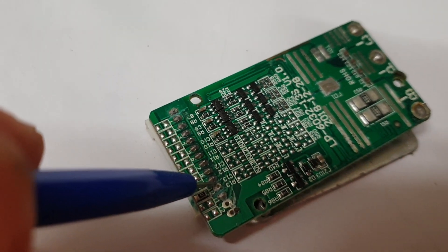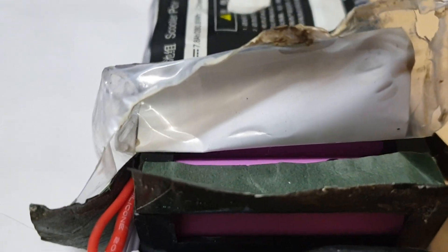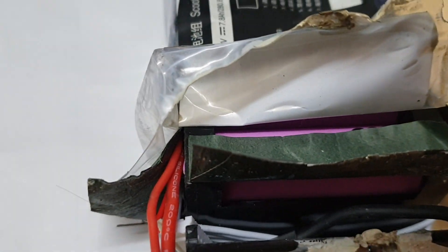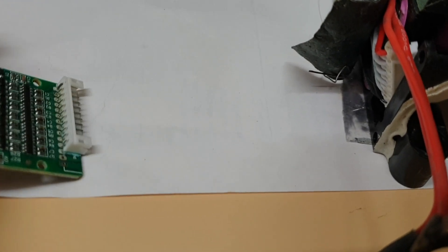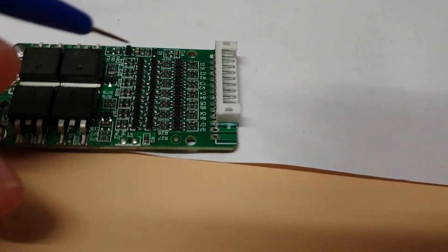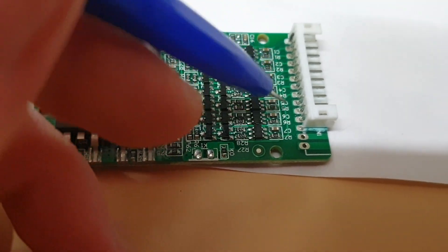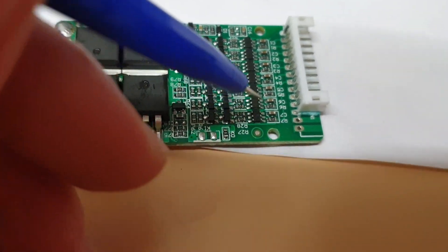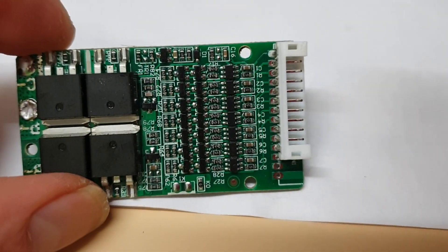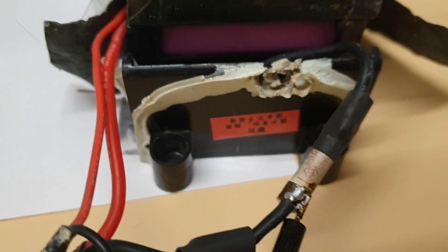The last set of cells which are faulty — I placed them just for testing with random cells. I will get the same cells like these basically. I don't know what this chip is, but it seems to have a balancer. These 470s are connected to each battery and there can be some switch inside this chip to do some balancing. However, here is how I repair this — old-school repair: remove this.